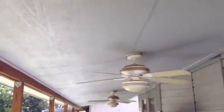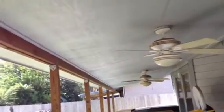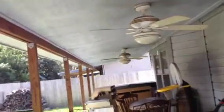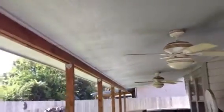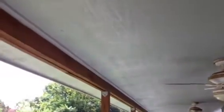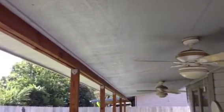We're looking at 2 options on the porch ceiling. One, we're going to possibly look at just painting it. It is an OSB, and I know we talked about that not giving the ultimate paint finish, but it's a huge porch. It's about 42 feet by I think about 7. So a huge porch area, not overly exposed, not in bad condition. So we'll look at the option of doing a Hardie plank or just painting what we have, with the expectation that it is a rough OSB board, so it's not going to have a finish like a smooth board after we paint it.